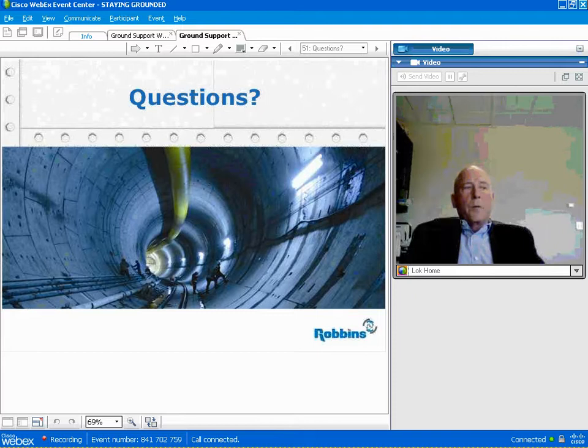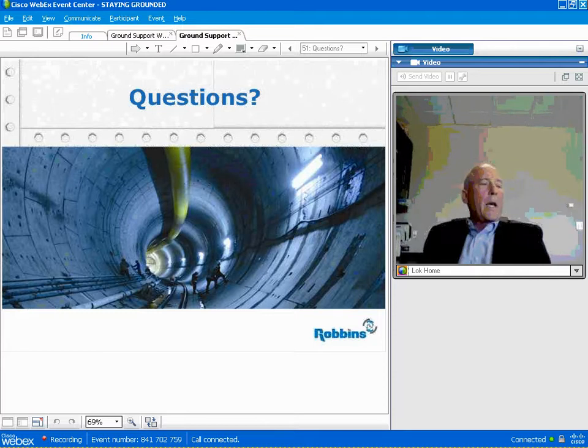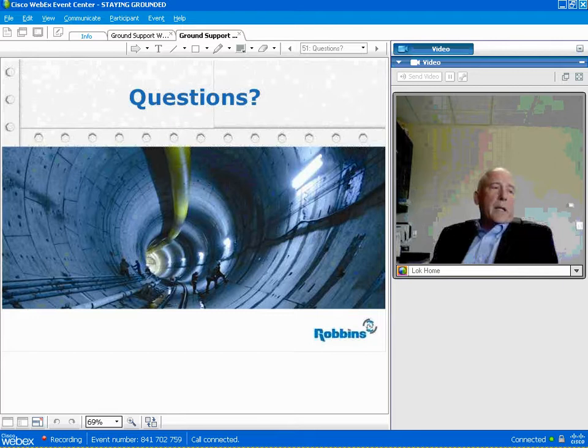I don't argue the case that segments weren't the proper thing there. The segments could have been the proper thing for the tunnel. I know we looked at that project, and I was okay with segments. I wasn't okay to have a classic standard double shield where you can't do good probing and grouting up front.